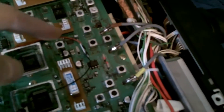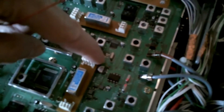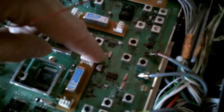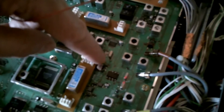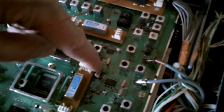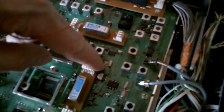Also there's getting power to it. For grounding, I could go to one of these cans or to any of these capacitors — grounding is simple. There is actually an 8V line just here; it looks like it's been modified, not by me. I've had this used, so it looks like that was a modification for the UK version maybe. There is a 7.9V source there which might be enough to power it, and the only worry is that there might not be enough current to do the job, or that it might affect the circuitry around it.